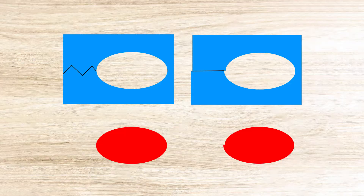As you can see in this diagram, a zig zag cut has no choice but to realign, whereas a straight cut can easily misalign which will transfer into your casting as a step in the surface of the cast.